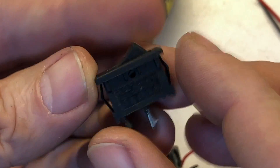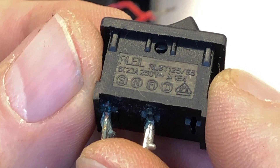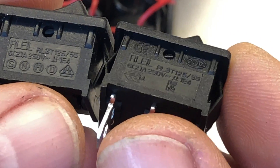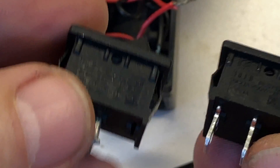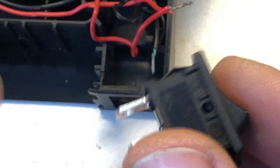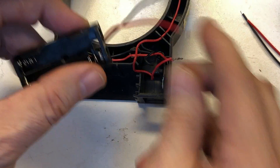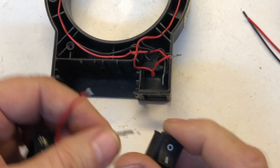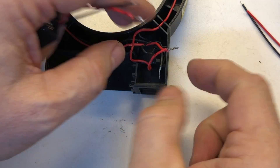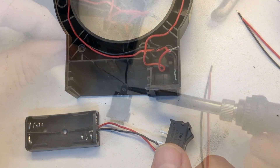Similarly, looking at the old switch, you can see an 'RLEL' part number on it, and I was able to find an exact duplicate online — again probably a clone of a clone. You can tell they're a little different; this is probably the genuine Sears-supplier part and this is the knockoff, but we've ohm'd it out and it's going to work fine. The circuit is pretty simple: positives go together, run one negative lead to the bottom terminal on the switch, then run the other negative lead for the two lasers up to the top terminal.